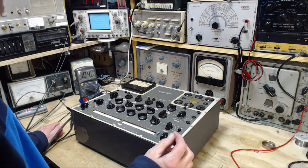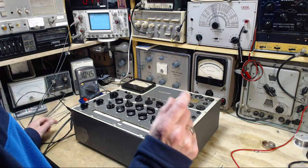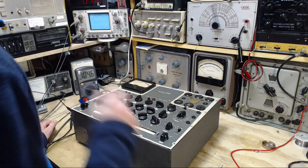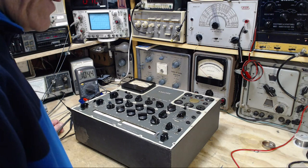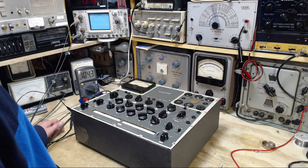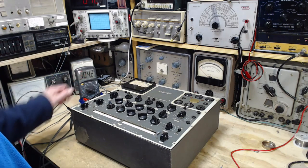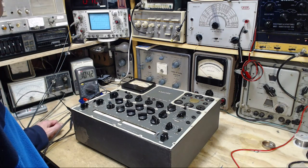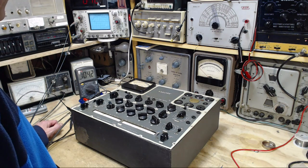But I would actually hook up a small, 10-watt light bulb between the cabinet and ground and see if the light comes on. And if it did, holy smokes. I think if the light were to come on, it would only happen if we were able to read 120 here, or the supply voltage. So where is this leading me? It's not leading me too far yet.